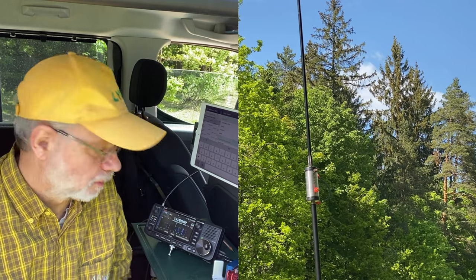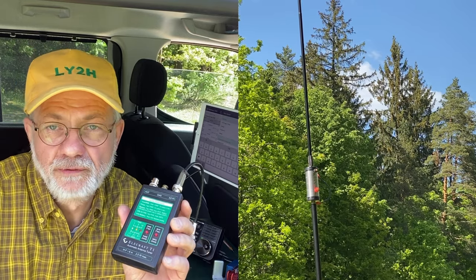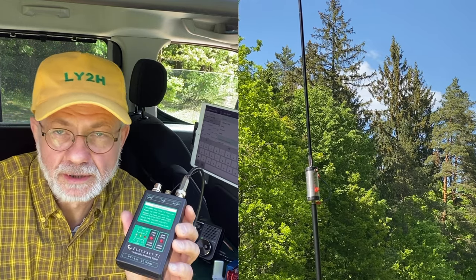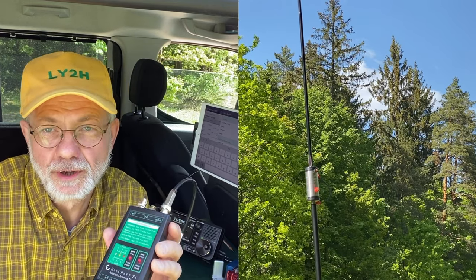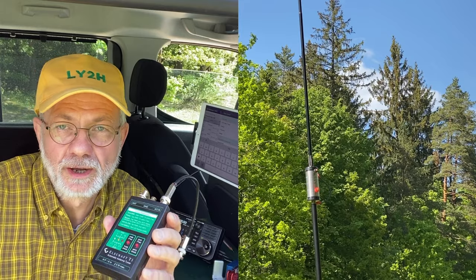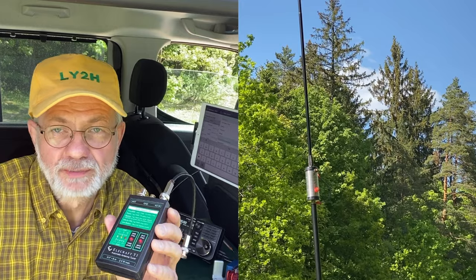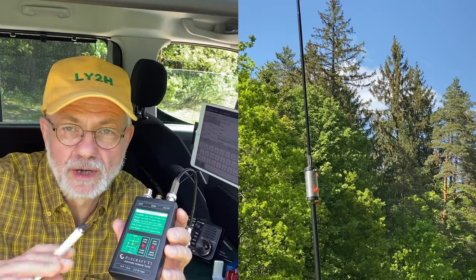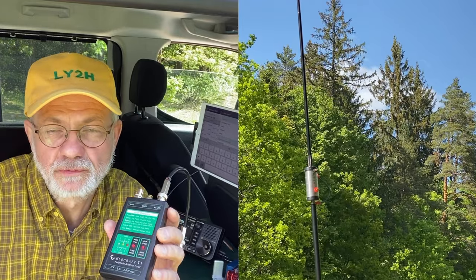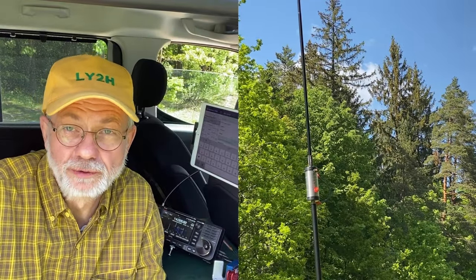But it's possible. Or if you have an antenna tuner, as I do, my favorite antenna tuner, the Elecraft T1, it tunes everything to anything, and it would save a lot of time tuning an antenna like the Buddistick, without much retuning of the whip and the counterpoise, just using the tuner. And then you may tune from 18 megahertz up to 28 megahertz, or maybe even 50 megahertz with a tuner. And yet another thing, if you have two Buddisticks, you can make one Buddipole out of two Buddisticks.